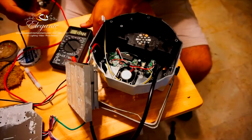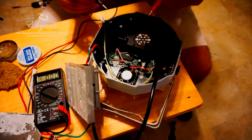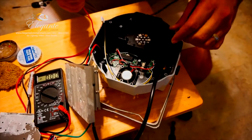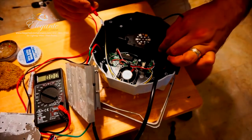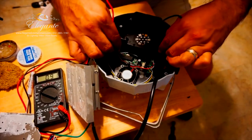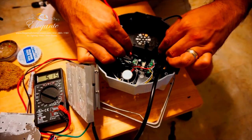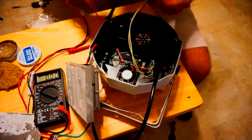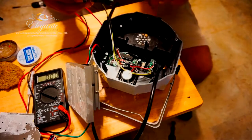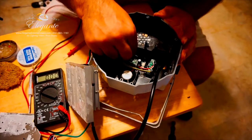At this point we're going to find the five volts on the board somewhere. I've already done this before so I'm just going to poke around - I forgot which lead of the big chip it was, so I'll poke around and make sure everything's plugged in. Here we have one volt - that's not enough. And here is where we have the five volts, so that's where I'm going to solder the red cable from the wireless DMX board into the main board.